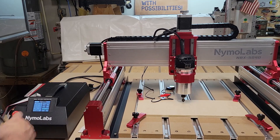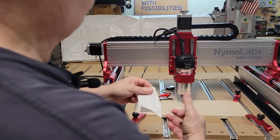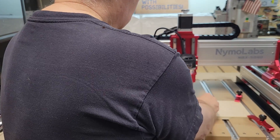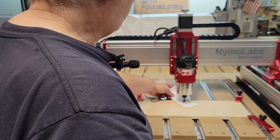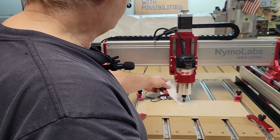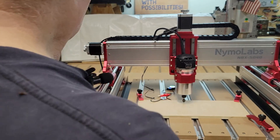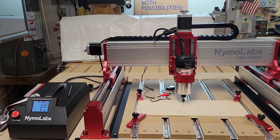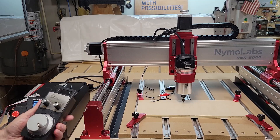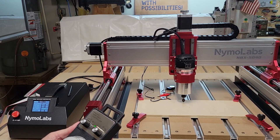Now the Z on the display is set to all zeros, so I'll just take a piece of paper. I know y'all can't feel that, but it is just dragging on that piece of paper — it is right at the top of the surface. So the Z-axis height probe is calibrated pretty well. Now let's raise the Z back up, home the machine, move it over, set it to our start point, zero it out, and then load in a program.